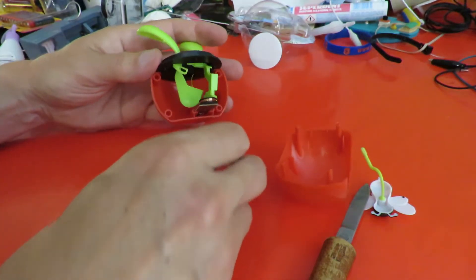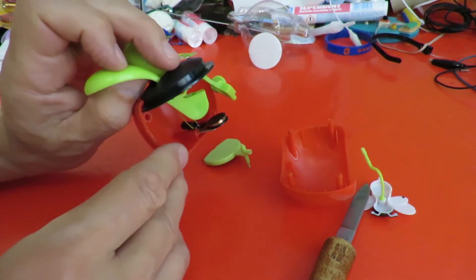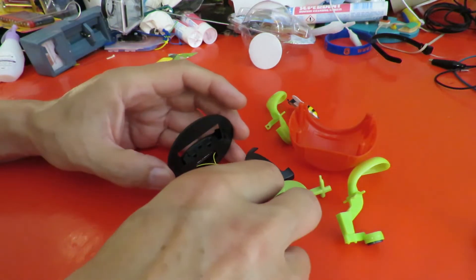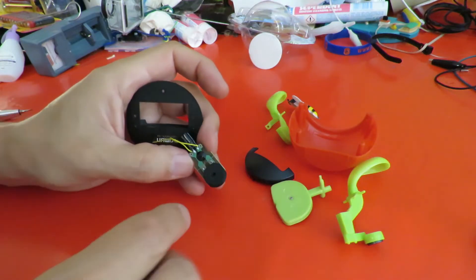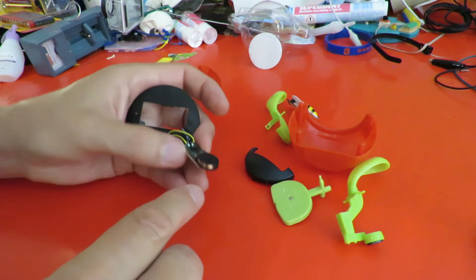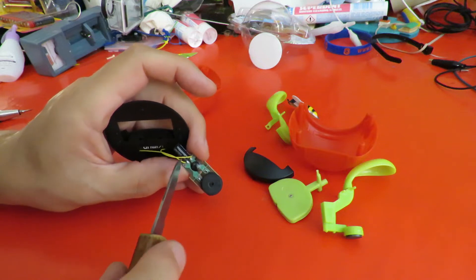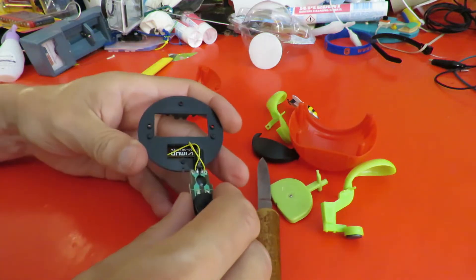All the bits have just fallen apart inside. So if you haven't taken one apart before — it might help if I just took these out of the way. Right, all in pieces now. So, little solar panel, nice little combined unit here. Quite often the coil is separate and you've got very thin wires that tend to get broken, but they've actually stuck the coil onto the circuit board here. The two wires that come out of the coil are soldered directly there. The black blob is the bit that does the clever stuff, and the capacitor is part of that circuit. Electrolytic capacitor, then the two yellow wires go up to the solar panel.